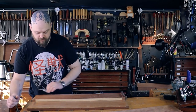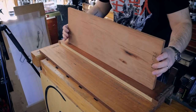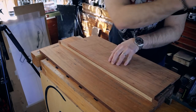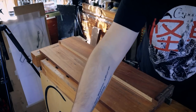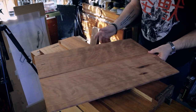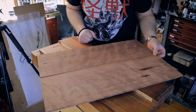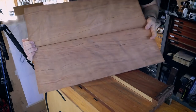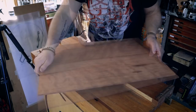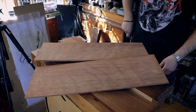This here is the shooting board. Absolutely integral part of life as a luthier. The wood sits on there, the plane goes, and it helps keep everything nice and square and sorted. Now, before you start, you need to figure out which side is going to be the top. Okay, so that's my top section.